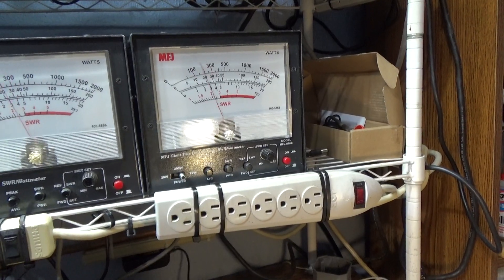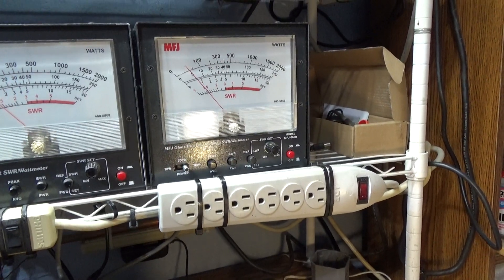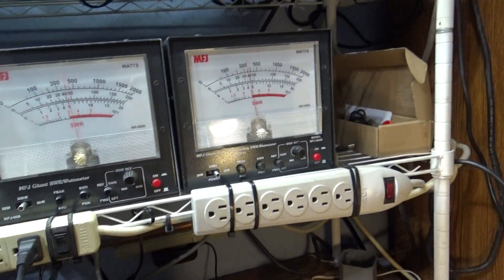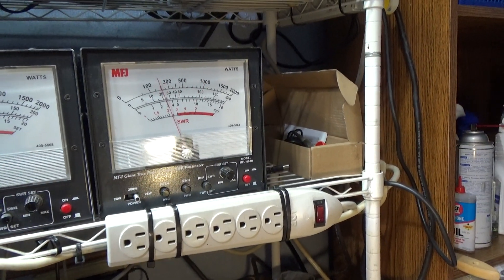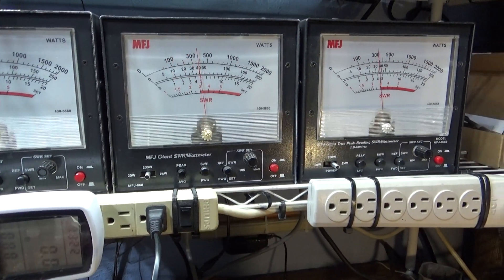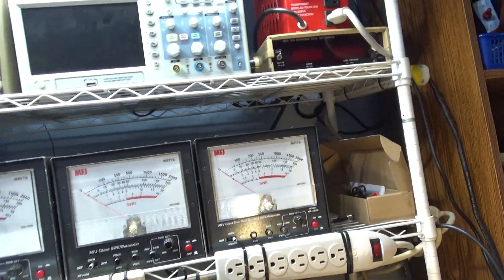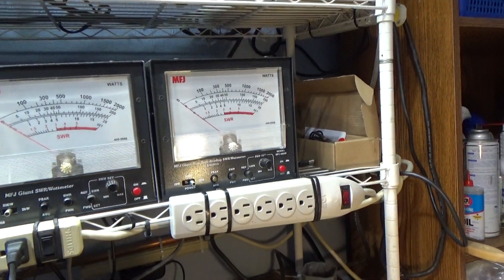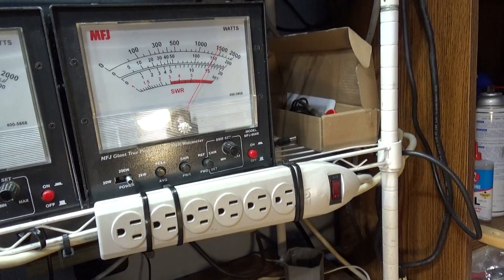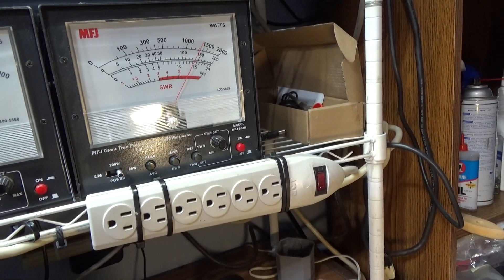That's a swinging machine with that variable bias and the Mako 75 hitting it. We're only dead keying about 40 watts on the Drake with about 5 watts dead key going into it. Whistling up to a thousand, and on average on the 2000 watt scale with about 125 watts whistle going into it. Putting it on key — not being hit hard at all with that Mako 75 single tuber — we're seeing a little over 1400, standing about 1400 peak.